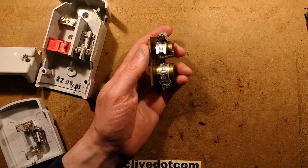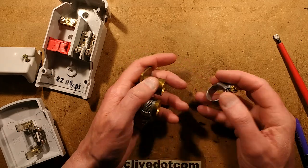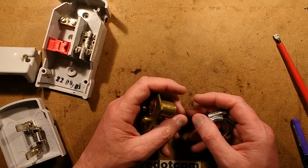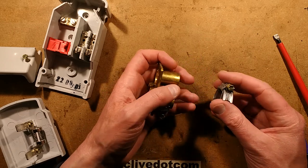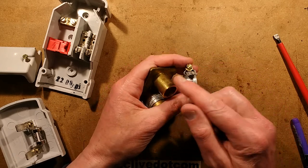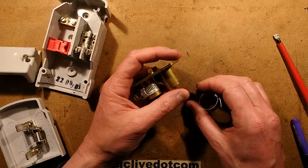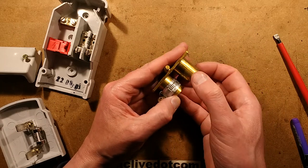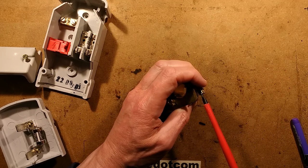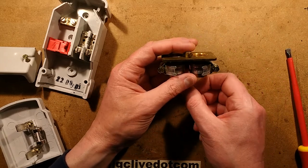In a compact space like this it's quite hard to terminate glands. Because a lamppost is effectively an electrical enclosure, you can have the exposed single-insulated cores inside — it's not such an issue. But this system is clever: you strip the armour, it's so easy. You can lift the whole unit right out of the lamppost to terminate it. You slip this fitting over the armour, put the armour strands over the outside of it, and then put a jubilee clip — or hose clamp — over them and tighten it up. It makes an outstandingly good electrical connection.